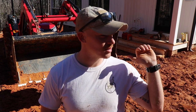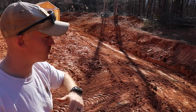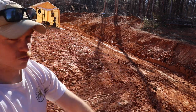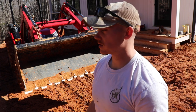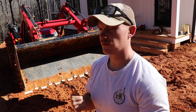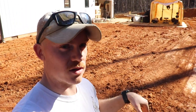I'm going to throw the drone up in the air. I'm cutting into this embankment berm on the side of our driveway area. I initially cut a little trench for the water to run in, but I'm going to smooth this out and make sure this side is lower so the water runs the way I want. If you're thinking about getting a tooth bar, maybe this will help your research. It came down to this one or the Piranha — and this one's made right here in North Carolina, so that finalized the decision.